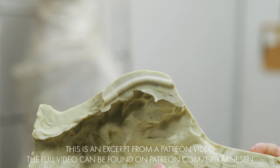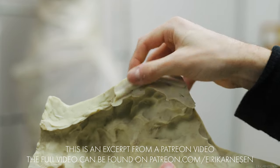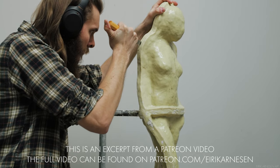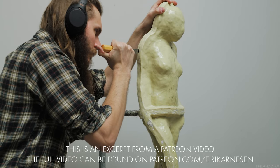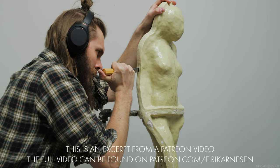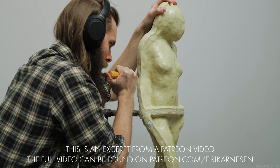To accomplish this task it's useful to make sure you can gauge the depth of your cut. You want the registration groove to be more or less in the middle of the wall, not at the top, not at the bottom. You can be sure of this depth if you make a little mark with a sharpie pen on the side of your blade and then just use that as a guide.